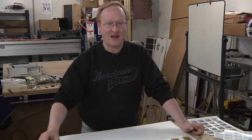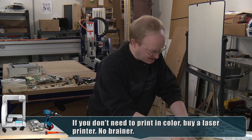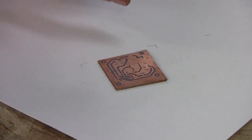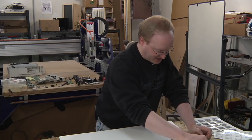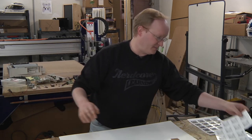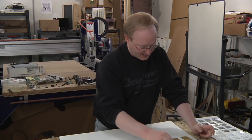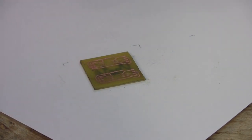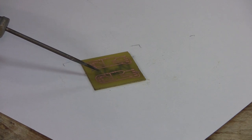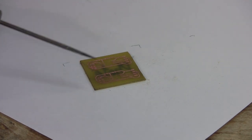While hand-drawing can work, if you have access to a laser printer, the laser printer actually did pretty good results. I always recommend people buy laser printers — they're a really good bang for your buck, super high quality, high speed, and the toner is far cheaper than inkjet. So after you do the transfer it looks like this — the black toner left over after heat transfer — then we hit it with etchant and we have some pretty nice traces. These were exported from Eagle, printed on glossy paper on the sticky side, and heat transferred onto the PCB. There are a few bridges here, but if we'd made the traces a little further apart it probably would have been just fine.